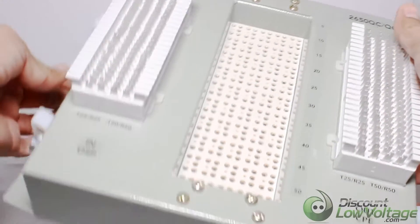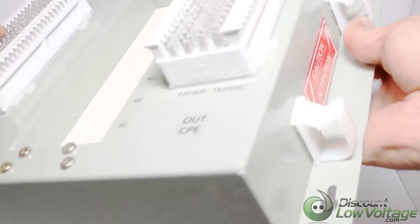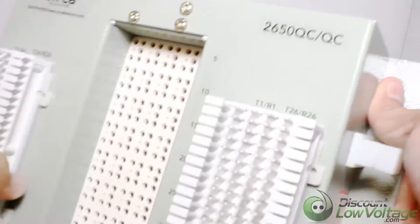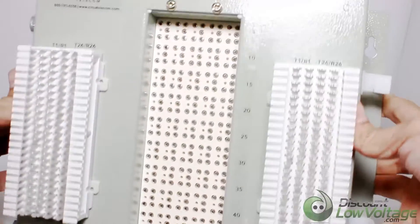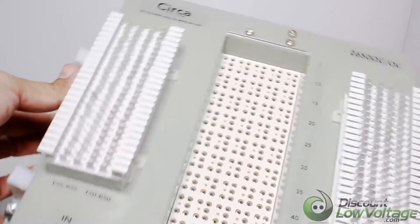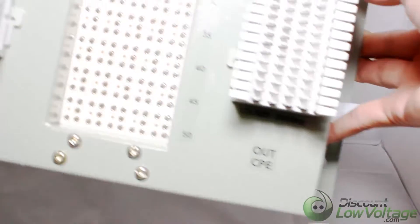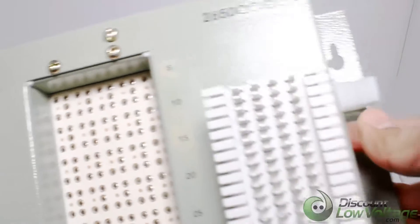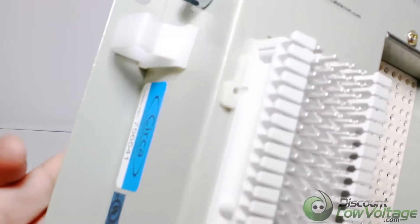The 2650 QCQC 50-Pair Lightning-Protected 66-Block 16-Gauge Steel Building Entrance Terminals feature reliable 66-Block-Style Quick Clip Connectors for both the input and the output terminals. Connectors can accept up to 18-Gauge line termination. Also included are multiple external and internal ground lugs, as well as splice chambers and various types of security covers. UL approval standards on all terminals. Standard 5-pin protector modules are available in analog and digital versions and can be purchased separately or loaded.